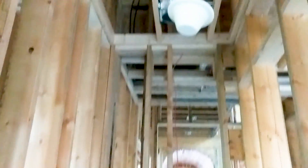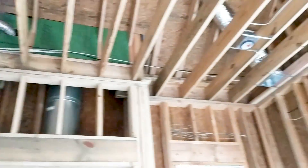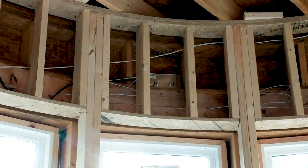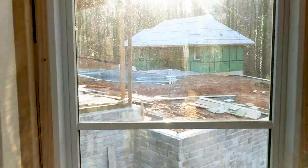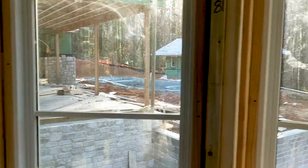There are two cables going that way. One panel is going towards the hallway covering that area of the main floor. They really wanted to get a signal out into the backyard, so I ran another cable all the way over there. I'm going to hide it behind the drywall. I've got an antenna there covering this part of the backyard — it's about a 60-degree spread — so it should cover nicely out there, providing cellular coverage in the backyard.